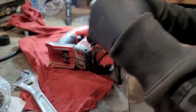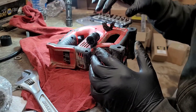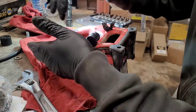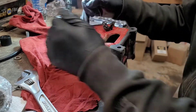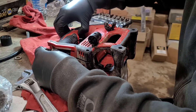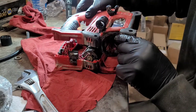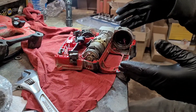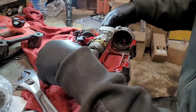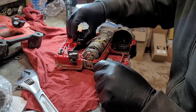I'm trying to avoid any little springs or clips falling out, so I just have to work this apart carefully. The biggest areas to pay attention to are up by the battery where the battery clips on, and your trigger. I don't know what kind of mechanism we have in there, so you just want to be careful, but if you work slowly this should come right apart. Okay, that went a little faster than I wanted, but there we go — that clamshell just lifts off.